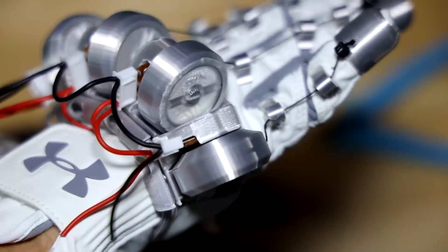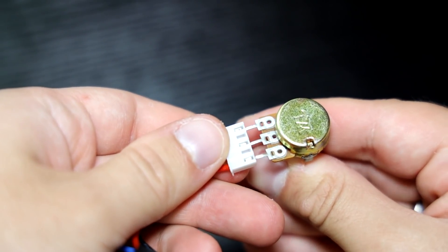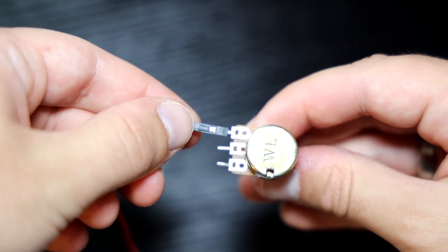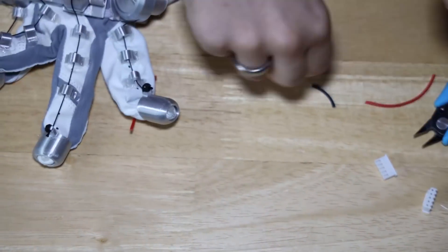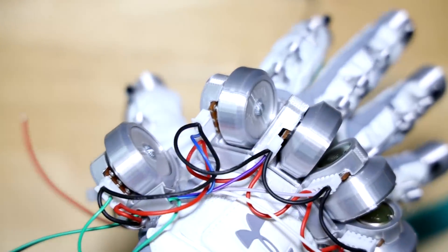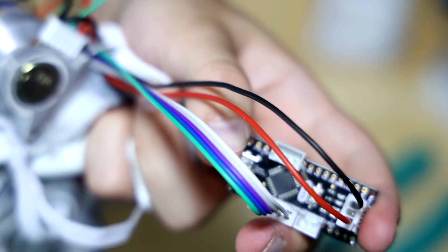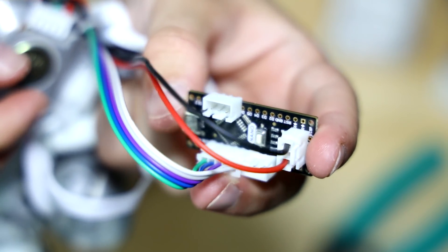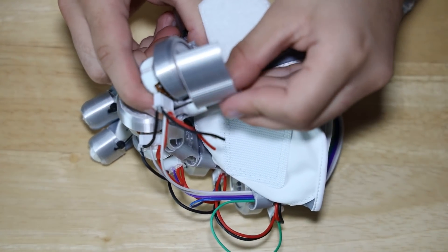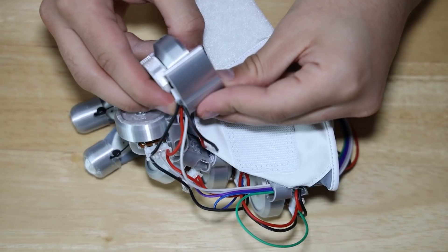If you have the right tools, daisy-chaining with crimps is a lot less work. You can solder directly onto the potentiometers or crimp connectors — I found JST connectors work really well. You can also use pre-crimped wires like those in an Arduino kit. Here it is fully wired and connected to the Arduino. For routing wires, you can use the built-in wire conduits in the holder part or 3D print the wire covers included in the STL files — those slide right onto the back of the holder pieces.